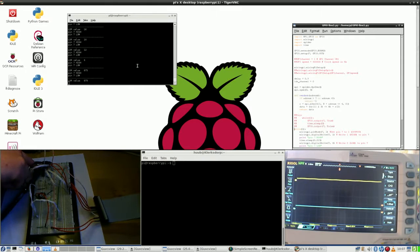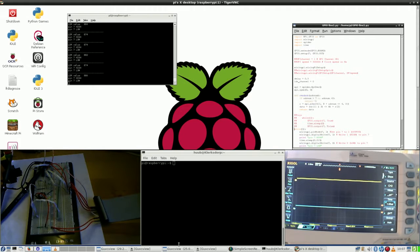And it's nice to see that this works, although it should have worked immediately and not giving zeros. But this is nice, and the oscilloscope shows it's always right. Right, I also intended to use another chip, the 23008, but that's I2C, and that is for another time, I think. First, can I use this ADC for more than one type of sensor at the same time?